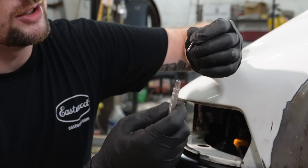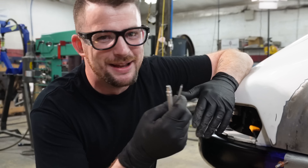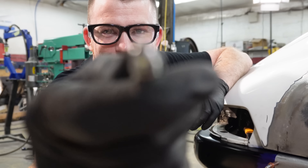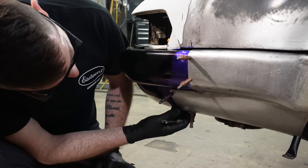If you're looking for one of these, I'd call it a scribe, but I'm actually using a tool for cutting glass I got off Amazon. There's like a five pack of these and it was like 10 bucks. Look up some glass cutters - it'll probably be cheaper than buying a normal metal scribe and it's really sharp and lasts a while. You can also change out the tips. Just don't get anywhere near glass, or like the lens of a camera.